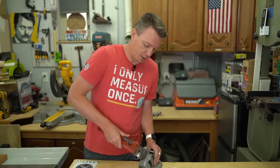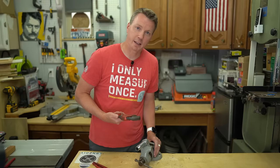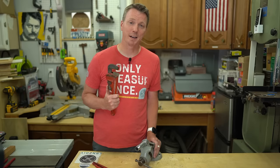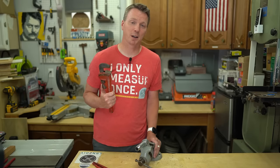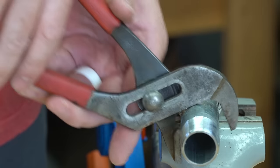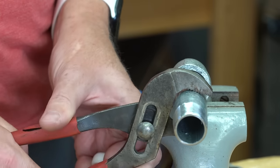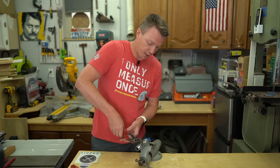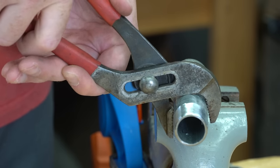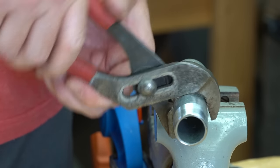It's a really handy little feature that a lot of people don't take advantage of — a really simple and clever design, and there's a reason it hasn't changed in almost a hundred years. The same principle applies for channel locks. There's no thumb release, but you want to grab it all the way down to the throat and make as much contact there as you can. It's going to be a lot easier to tighten from there rather than trying to grab with the ends or the middle of the jaws. Just see if you can grab it all the way down for maximum contact with the jaw teeth.